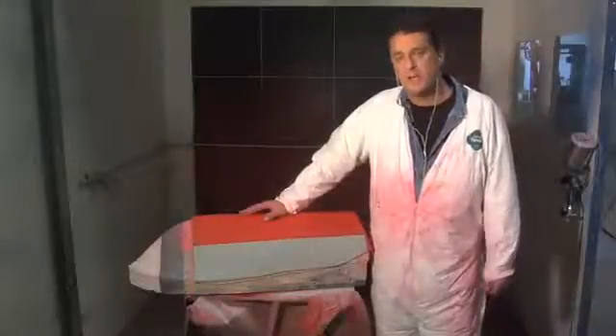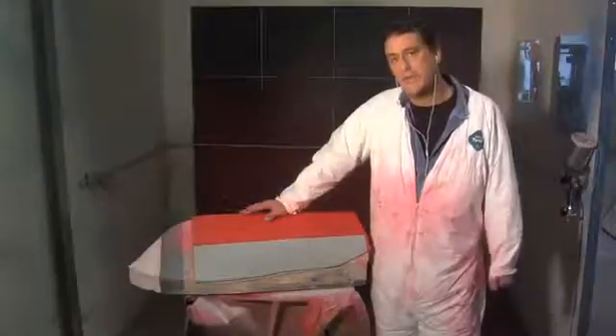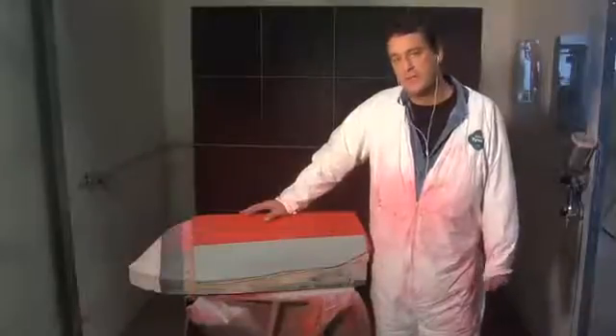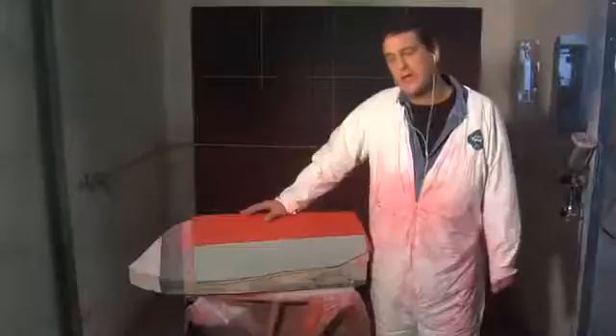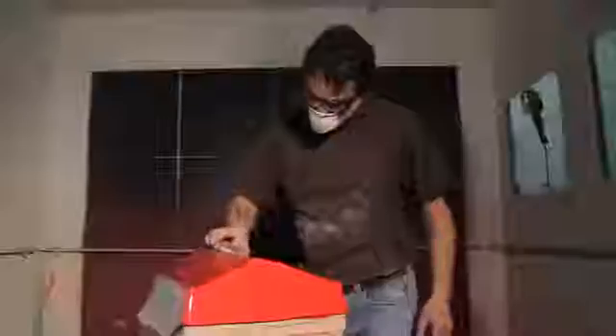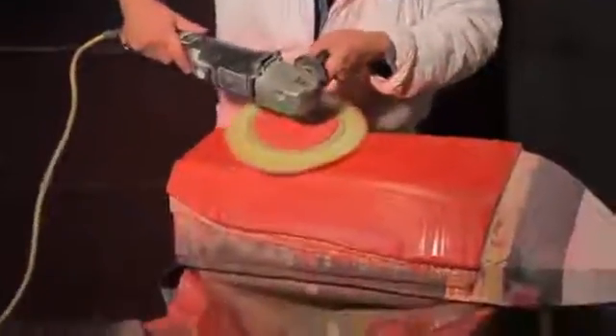I'm Harley Carlson with Hawkeye Industries. I'm just going to talk to you a minute about what choices I used for sandpaper and how I sprayed this. Initially I sprayed the surface primer and it leveled out nicely to where I could begin dry sanding with 220-grit paper. After I 220-sanded the primer, I was able to apply the top coat. The vinyl ester top coat flows out very nicely and I was able to start sanding at 320 just to remove the orange peel. I will then go to wet sanding — all I'm now doing is removing the 320 scratches with the 400. I will wet sand from 400, 600, 800, and 1000, and then go to buffing.